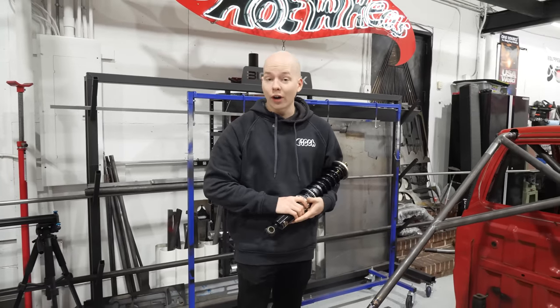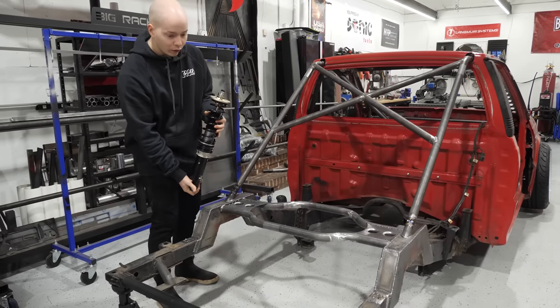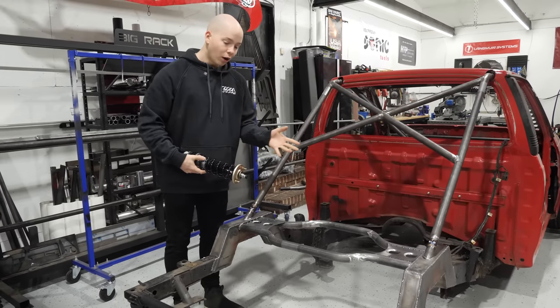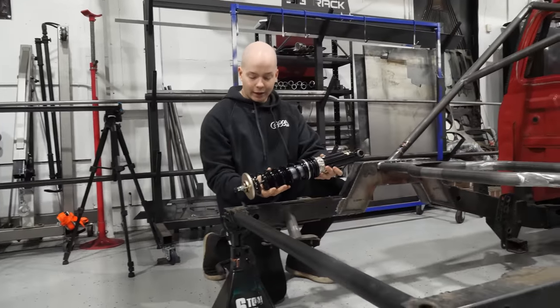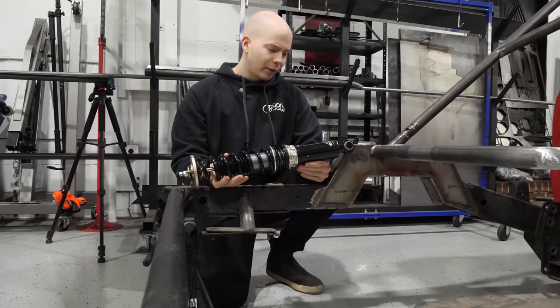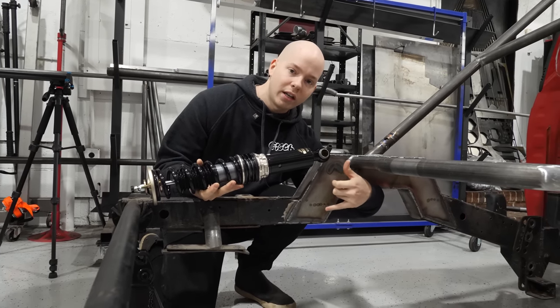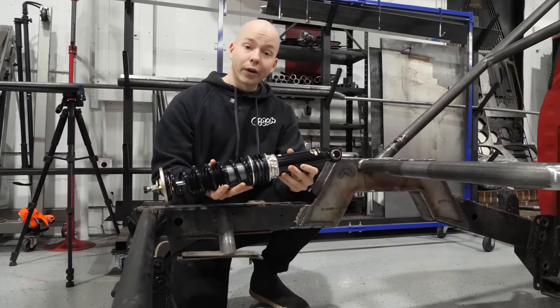This thing's also gonna be a work truck, you know? Gonna haul metal to the store and stuff. We don't want coilovers sticking all the way up into the bed, ruining any bed space. So, in order to fix that, you mount the coilover like so. I mean, look, that's like it's meant to be. With a hinged joint here, and then the bar goes down to the solid axle. So that's what we're gonna be doing on the truck. It's gonna look cool, and it's gonna save space.